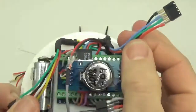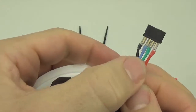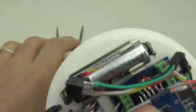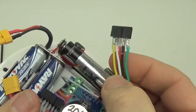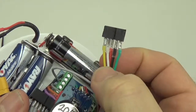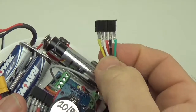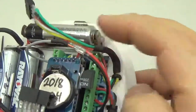I'm very careful about color patterning, so for example, LEDs always have matching wires to the colors of the LED. But occasionally you end up with situations where your buses have colors that are overlapping, especially if you use a pattern like I do. So the white would be the data line and the yellow would be the clock line, even on different buses. So sometimes it's a little bit hard to tell them apart, and you can put them in different places with this technique.